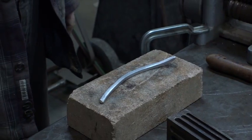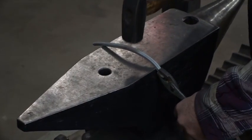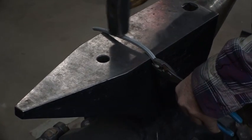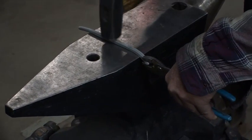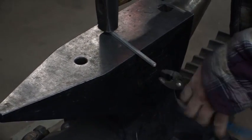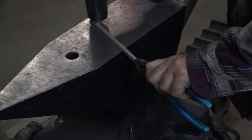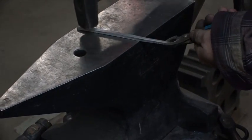We're going to take it over here now. You would never want to do this when it's red hot — your metal will crack. Make sure you wipe your anvil off and then just gently form it down. Don't get crazy with it; we're just trying to make it straight — not that it won't get bent again when we roll it. There we go. Now we take it and spool it off a bit.